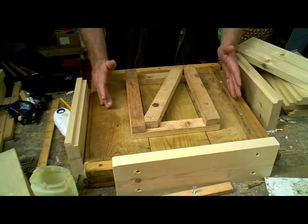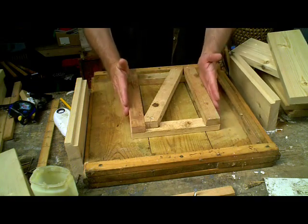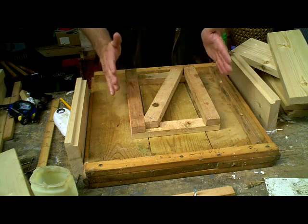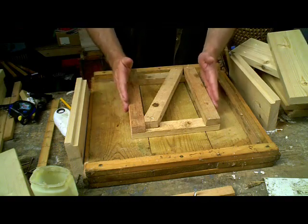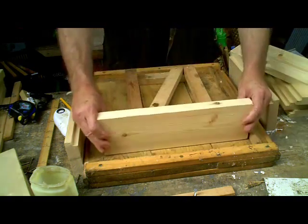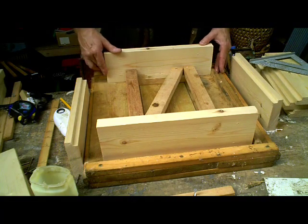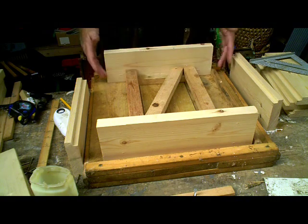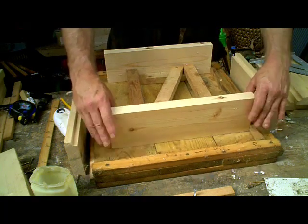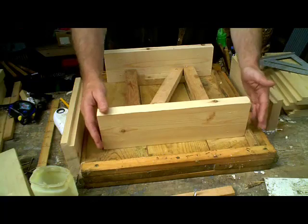Here is my jig for what I call my versatile vertical hive. As you can see, it comprises a section in the center which has the precise measurements of the interior of the hive. Each box of this hive is made up of four sections. This section here slots neatly into a recess that is made exactly to its size and goes up against an end stop here. This one just sits against the interior measurement and against the end stop.